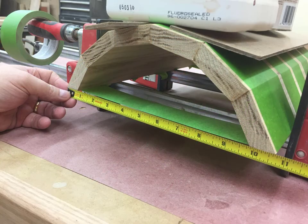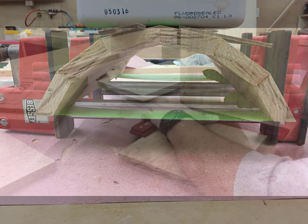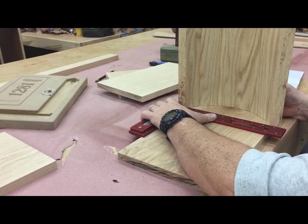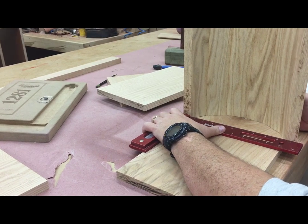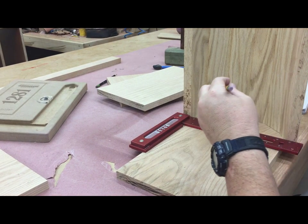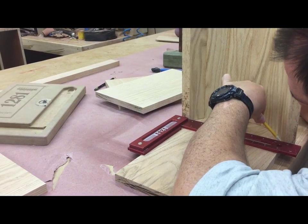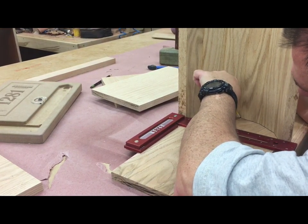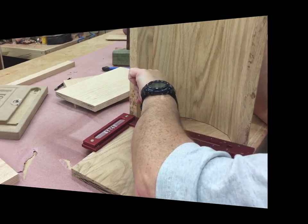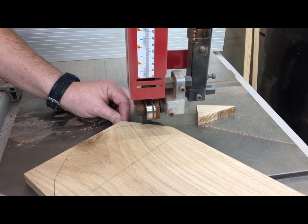I do know the exact dimensions of the box, so I just want to double check the measurements on the size of the lid to make sure that matches up. Once the top's all dried, I can take it off and set it over one of the side pieces. This way I can actually trace the exact shape of the lid and cut the side out to fit. Over on the bandsaw, I'll try to cut that trace out perfectly.